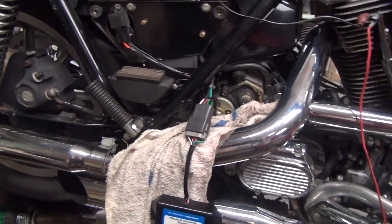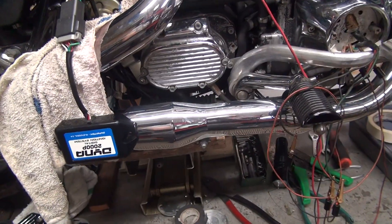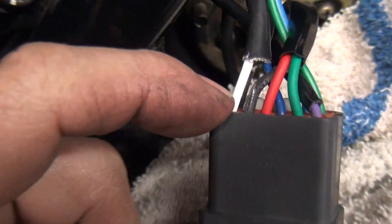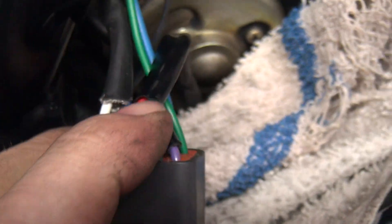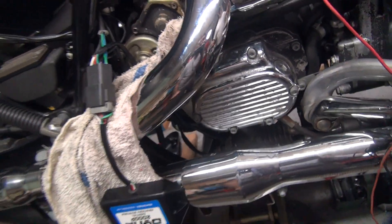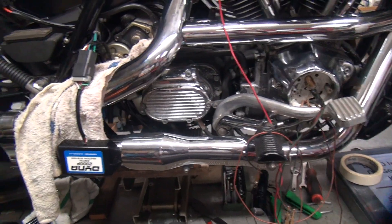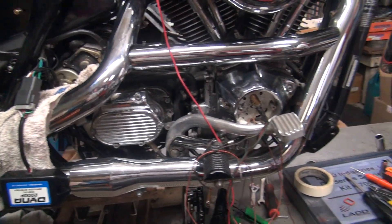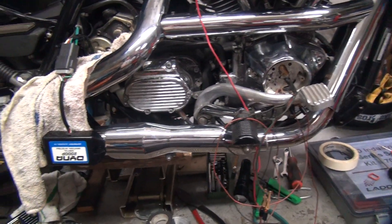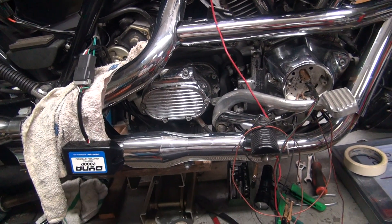Now we've got both modules working, we've got to figure that out. We're going to go ahead and get a new pickup, eliminate that piece of crap plug, and I don't like how this black wire here is all crappy looking. So we're just going to replace this whole three-wire harness - put a whole new one in because this is old, hard, and stiff. We'll make up a new one. I'll bring some wire - I've got lots of the good small stuff. There's at least three foot of wire there, and half of it's going to come with the new module. I'll install it for free.